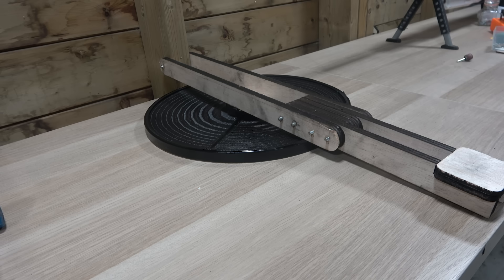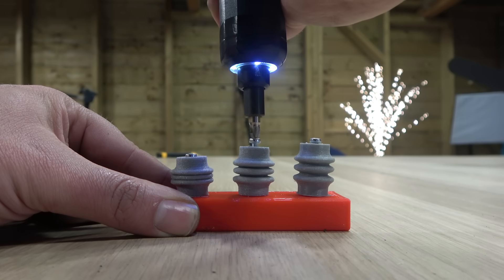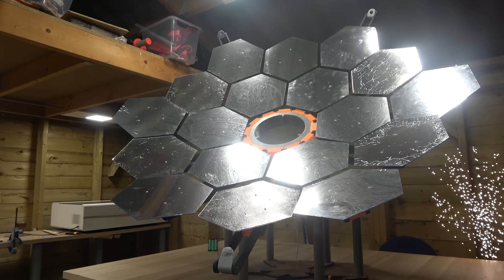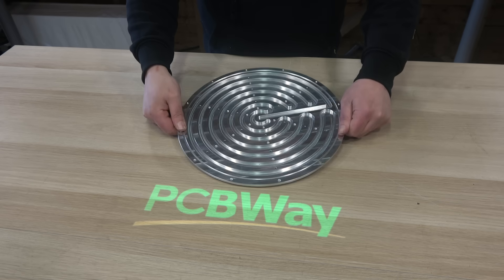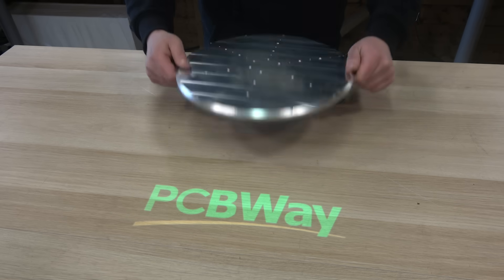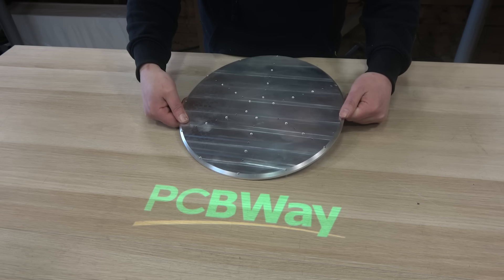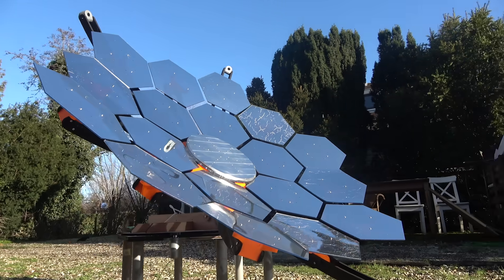After reheating and reshaping all 18 mirrors, we can finally mount them — but first we need some springs. The 3D printed TPU springs are still elastic after being fully compressed for a few hours — the initial spring length fresh off the printer was 30mm, and they held up well. With all the mirrors mounted, there is still a large gap in the center where an aluminum heat plate, CNC machined by PCBWay, will go. It keeps blowing my mind how they managed to deliver such high quality custom parts so quickly at such competitive rates — this heat plate was delivered within 6 days for just $171. Special thanks to PCBWay for sponsoring this video; check out the link in the description.